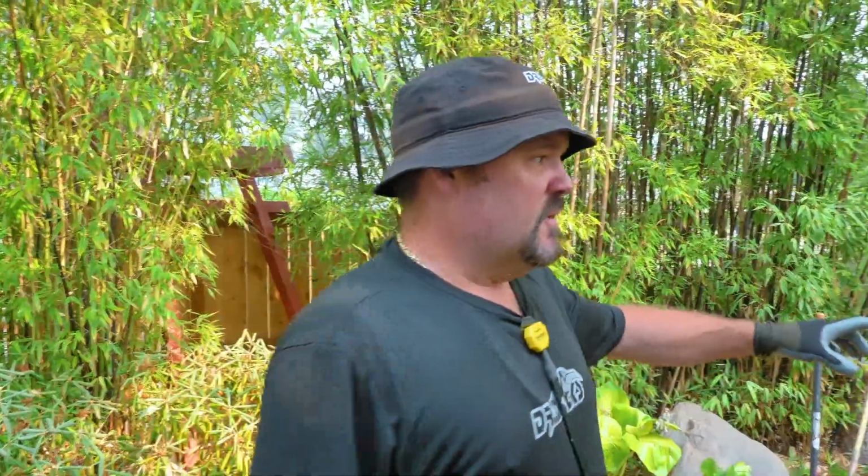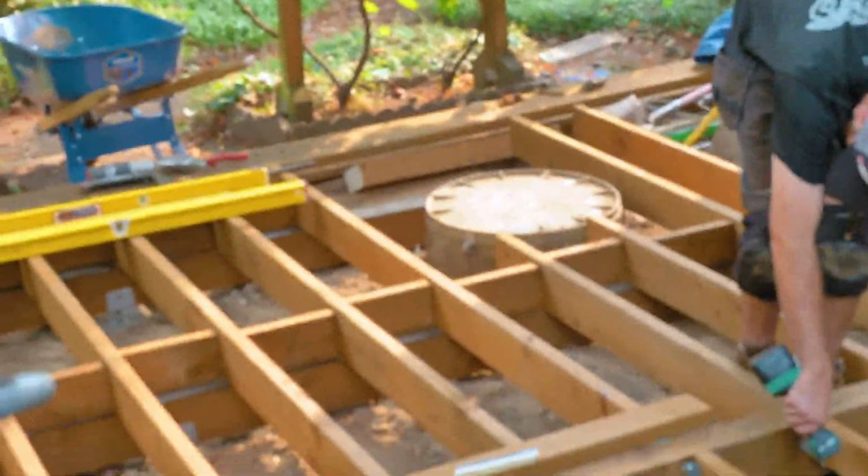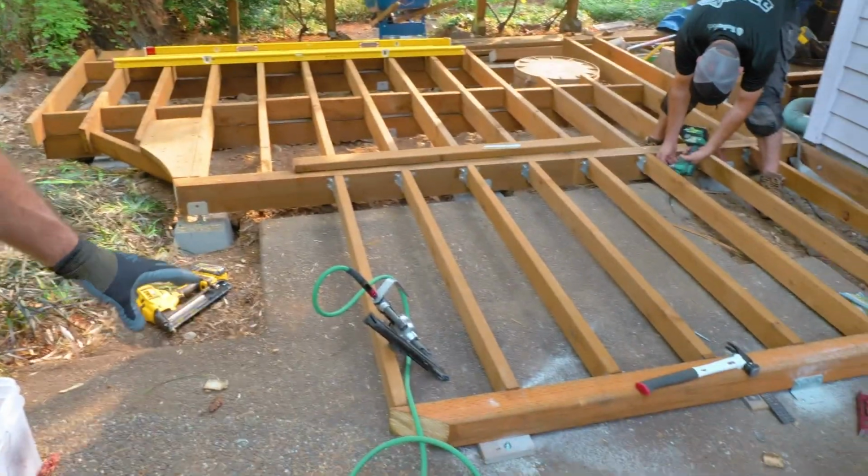So as you see over here, we also have a sewer grinder pump that we have to have access to. And part of this deck we framed in 2x6, which is pretty thin, but then some of it we're going right over the top of a concrete patio. So that has to be framed in 2x4 because that's all the space we have. And it's also really at a level. So the old deck kind of sat right on the patio and it was starting to decay and rot. So this time we're lifting everything up about 1/2 inch to 1 inch, so it keeps all of our framing off the ground. That way it doesn't rot or fall apart or decay.